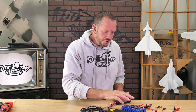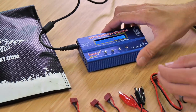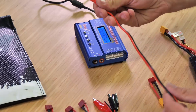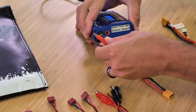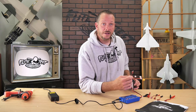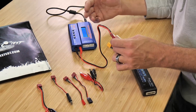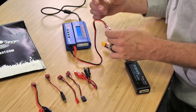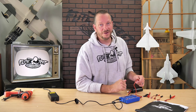Let's go ahead and plug in our battery charger and we'll talk through the modes. On the side here you're going to see DC input 11 to 18 volts — we're just going to plug this in and it's going to power on. On the other end, we locate our power output that goes to a Dean's connector and we plug that in black to black and red to red. Now because our batteries use either XT60, XT30, or XT90, we're going to plug in the adapter we include. If you're using the XT30 or XT90, we have battery adapters or an all-in-one pigtail that plugs right into this battery charger.